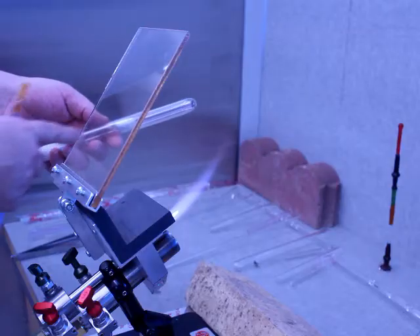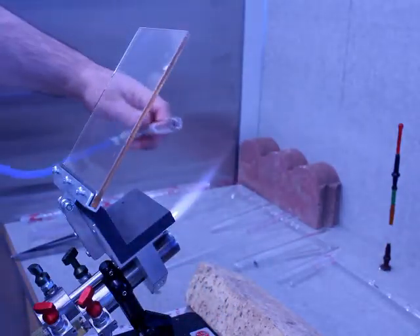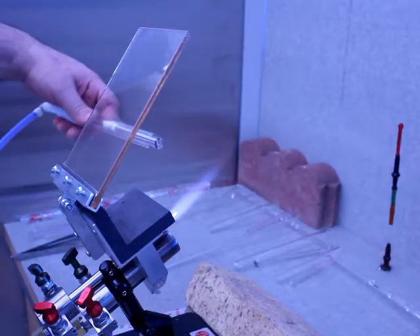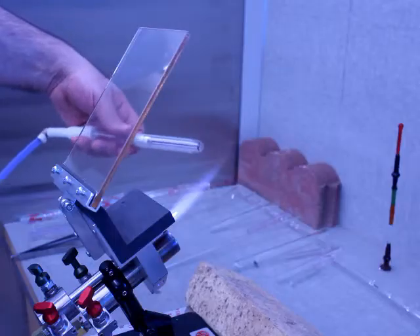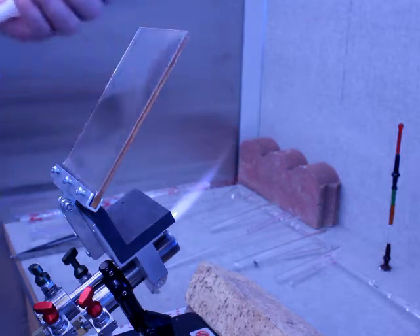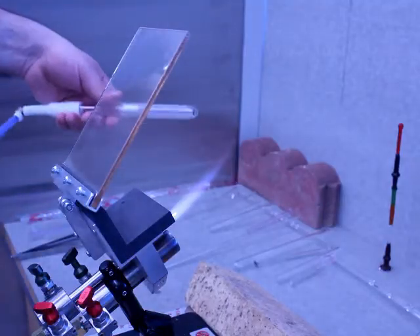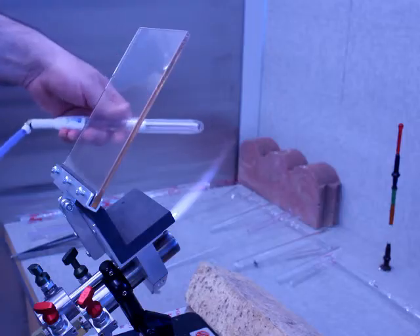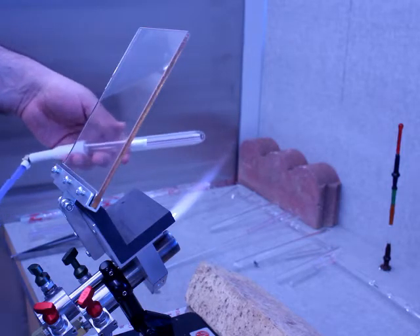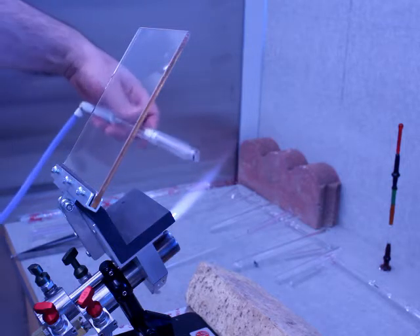For the prep work, I have that spacer I talked about. I've got this purple tubing on the inside and a colorless borosilicate on the outside. I have this all hooked up to a blow hose. There are several ways to make ring seals — this is a very standard way from what I've seen, both from my own experience and from reading different scientific glass textbooks. What I've done a little differently is created a spacer that helps keep the inner glass tube centered so it's not wobbling around. You can do this with cardboard, and that's how I was taught. The only problem with that is, with a narrow tube like this, getting the cardboard in and out is very difficult, so I came up with this idea of using a glass spacer.